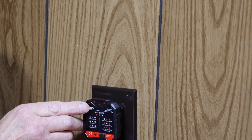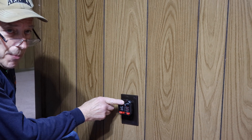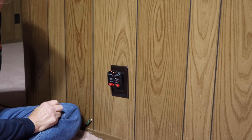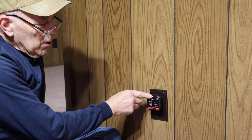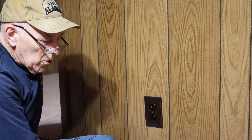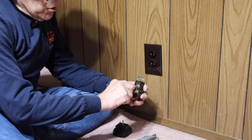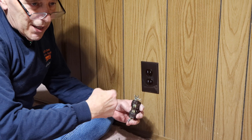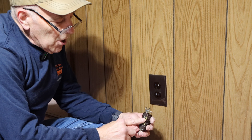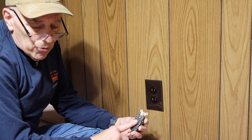Let's put our tester in here, turn the power back on, and if everything is correct we should have two red lights here and this other light should not light up. The power is back on and it's set just the way it's supposed to be. One final tip: make sure when you create that loop to put it on the screw, you have it going in the correct clockwise direction so tightening pulls it tighter. And make sure they're nice and tight — don't use the push-in method or you're going to have a problem down the road. Thanks for watching and I'll see you on the next one.